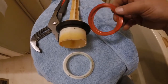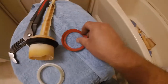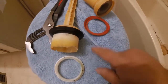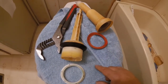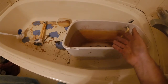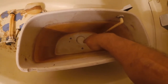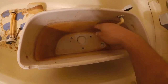This is the issue I was having with the tank constantly trying to fill up. This part itself was working fine, but since this gasket would not seal, this piece would come down. It was a very slow leak into the bowl of the tank — just enough that maybe every few minutes or so it would try and fill up, and eventually the water pump underneath the house would come on. Within half a day, this would empty right out — so essentially twice a day this would have been emptying out and filling up unnecessarily. I did clean out the bottom inside here because I want to make sure when I put everything back together there is no dirt or any small pieces of leftover stuff that would cause it to not seal.